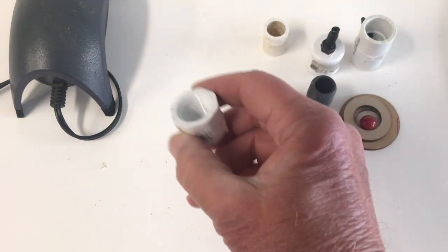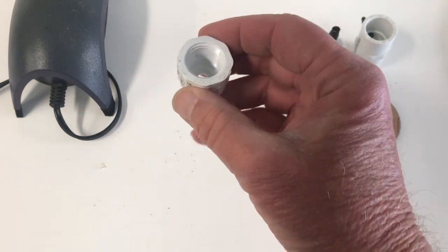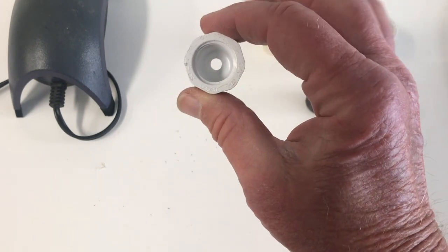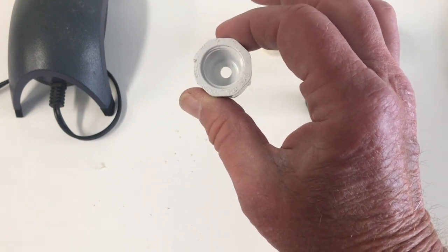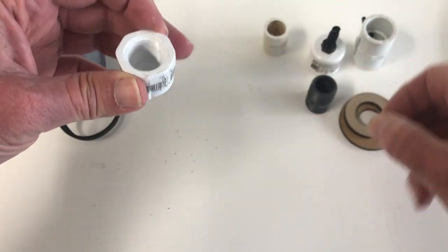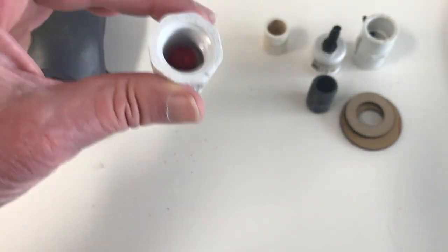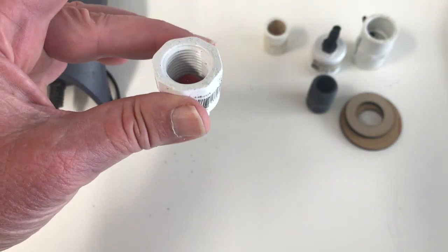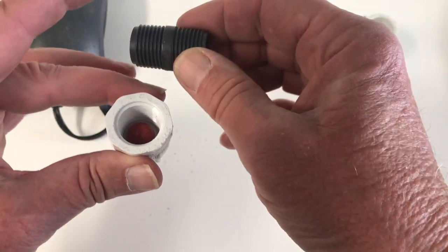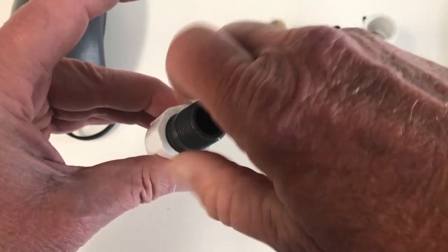The design starts with a threaded half inch end cap. This end cap is drilled with a quarter inch hole in the bottom. Then I use a countersink tool — you can see it there — to countersink the inside of the hole. The reason I do that is that the marble acts as a check valve, and the countersinking keeps that marble in there very reliably so that if the pump tips a little bit left or right the marble will still seat in the bottom. The second piece is a two inch riser and that threads into the bottom piece.